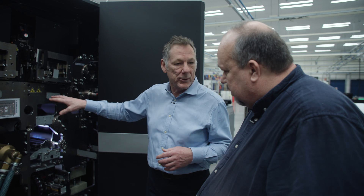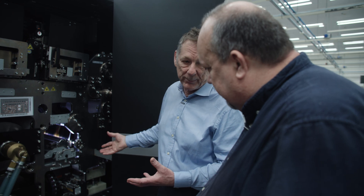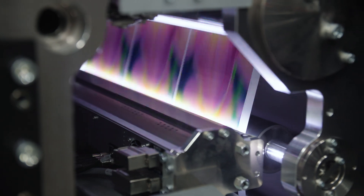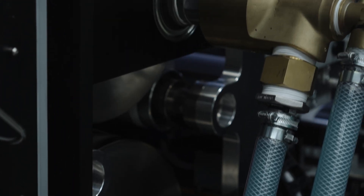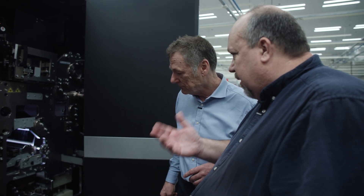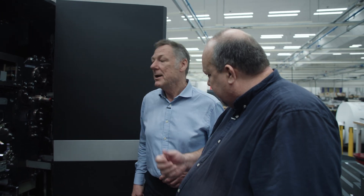The other key parts to focus on are a camera system and a spectrophotometer. Like in the lithopress, we can measure color and correct color in real time. The camera system records everything from jet-outs to uniformity to alignment, making corrections in real time. This is a really unique feature offering huge benefits from automation. Every sheet that comes out of the machine has quality assurance because of these systems — everything is captured and corrected so you can be sure that what comes out at the end is usable print.